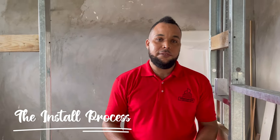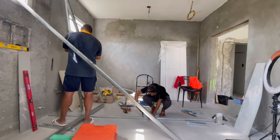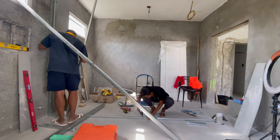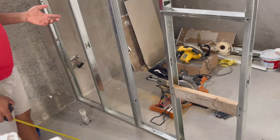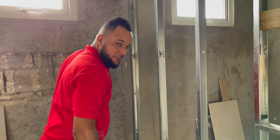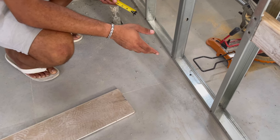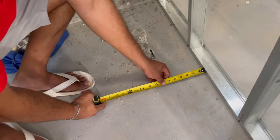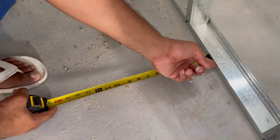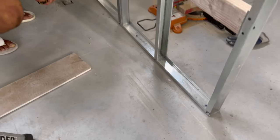The process that we use is to ensure that you have your dimensions already laid out, and you're going to start with the track. The first one that we laid down was this track right here. We tried to figure out how to get it straight. My laser level wasn't working, so an easy way to define what is straight is to go based on the tile. If you follow the grout lines in the tile, hopefully you had a good tile install and they would have already ensured the room is square. We measured 6 inches or 5 and 3 quarter from the edge of this track to the grout line. You can also use a chalk line, stringing a line from one end to the other to mark it from.